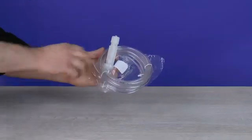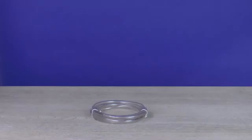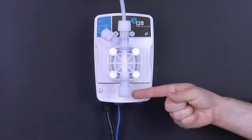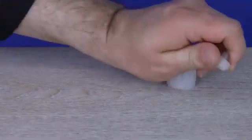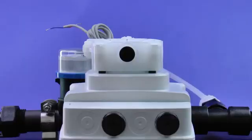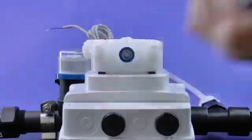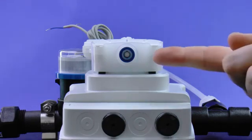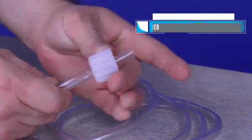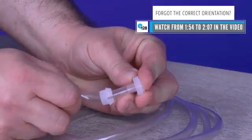Suction valve. Remove the larger clear flexible PVC suction tubing from the installation kit and set it aside. Locate the suction valve at the bottom of the pump head and remove the suction valve tube nut, collar, and nozzle — set all three aside. Check to see if the black transit washer is stuck to the nozzle and remove it. If not, see if it is at the bottom of the suction valve; you may need a flat blade screwdriver. Make sure not to lose the blue O-ring directly at the bottom of the suction valve. Slide the tube connections onto the loose end of the PVC suction tubing, being mindful of orientation.